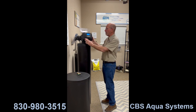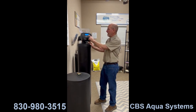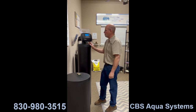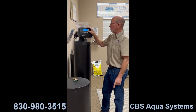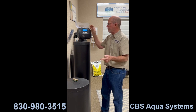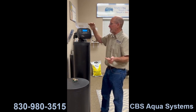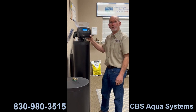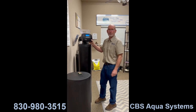So what you could do, if you looked at this number and it said it was down to 50 gallons and you think you're going to use more soft water out of this added hose bib than is remaining on this screen, you might want to wait one day, let it regenerate that evening so that you have 1,000 gallons of capacity left, so that you don't get any hard water bleed through into your tanks or while you're washing your vehicle. Hopefully that answers the question.